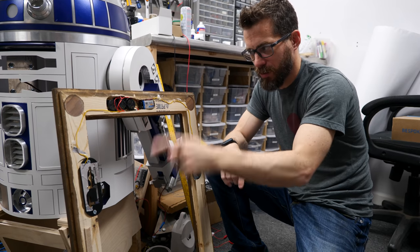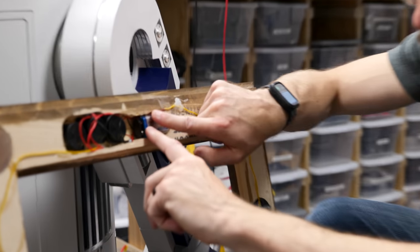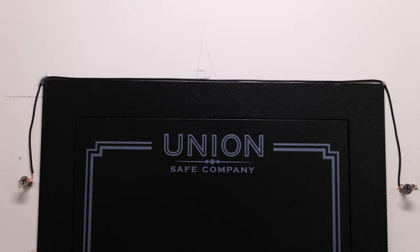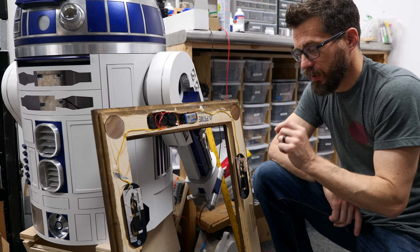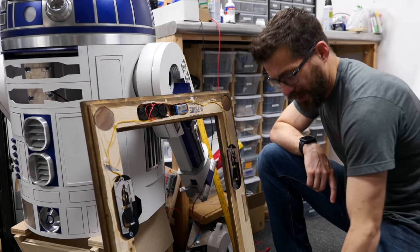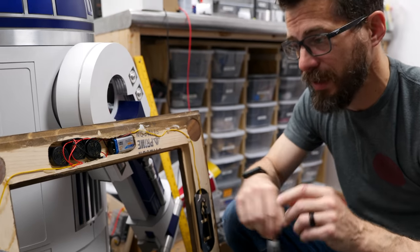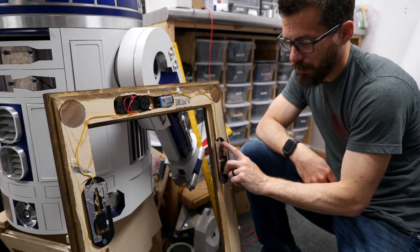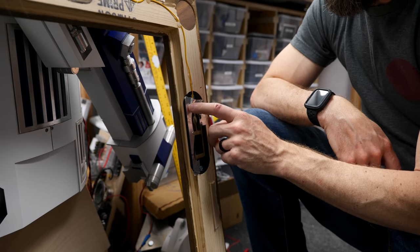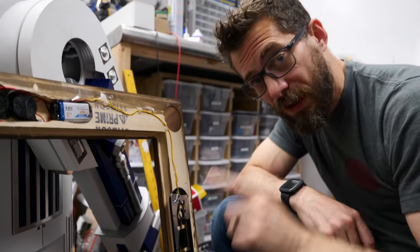I ended up trying several different things to make this circuit work. The battery is in the center — one terminal from each side of the battery goes out, and basically you're connecting this side to this side when you hit these rails via the wire that's wrapped over the safe. To get this circuit to work, I tried soldering on aluminum tape, which I couldn't do. I tried overlapping the tape in different ways. I used something called electric paint, which does work really well, but this tube is about eight years old so I think it's just bad. What I ended up doing was using a single piece of aluminum tape to cover the entire thing and then cut away the parts I didn't need — that acts as a really nice conductive surface. The wire just goes underneath it and is pushed down so they touch and conduct. This thing should be set up. I think we can put a picture in the frame and go try it.